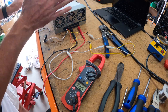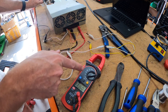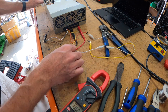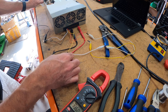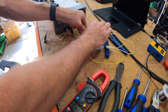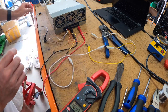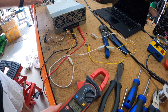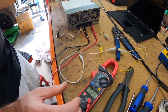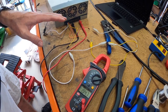This is now going to be the on switch to actually activate the power supply. And you can see there with my trim pot, we're outputting 13.6 volts. If I disconnect my trim pot — it's going to be these three wires — and power it back on, you can see it outputs 12.2 volts at no load. So I assume when you actually hook some load up to it, that's when it will output its 12 volts, which is what it would have needed in the computer setup. So I'm confident we can get it outputting the right voltage.